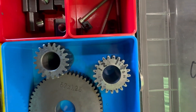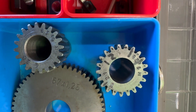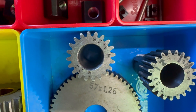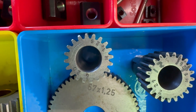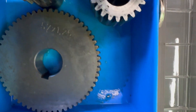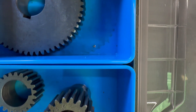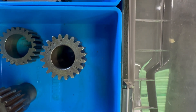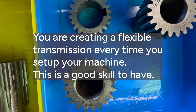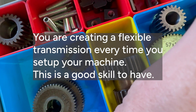Number four: confidence. When buying new and used machinery, there's some fantastic used machinery out there that can perform many tasks beautifully. If you understand the input and output shaft and the gearboxes they're in, you can figure out the flexible arrangements and the banjos to put the gears in the right orders and basically make this double reduction gearbox, which is essentially what we're talking about here.